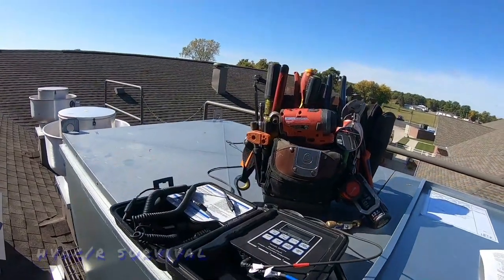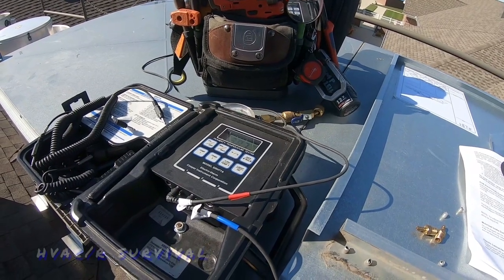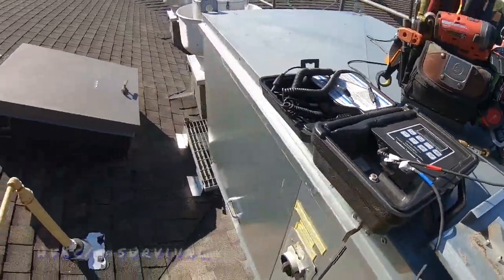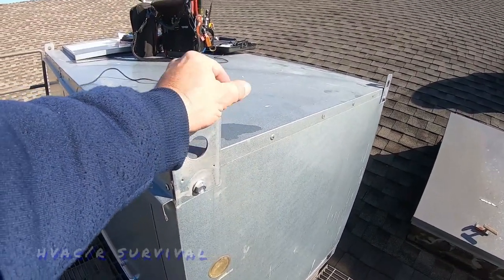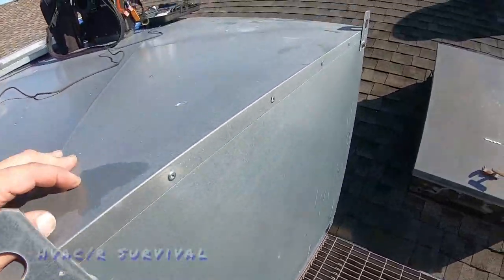I cleaned the flame sensor when I first got here. Couldn't get a good description of what was actually the problem — just felt a little cool is what I was told. You can go over here and check the flame — it's all UV-bleached out and you can't see it, but if you cover your hand you can see it's running.